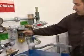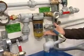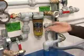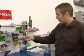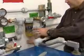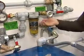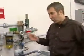Here we have the filter for the incoming fuel. This is part of your daily inspection — you check the filter bowl for any residue or water. If you start seeing any, then you have to change the filter. There's a filter element wrench here sized for taking the bowl off. To change it out, you would shut off the valve, get a bucket, drain the fuel out of the bottom of the filter, take that off, install the new filter element, reinstall the bowl, and open the valve back up.